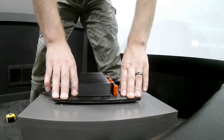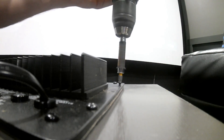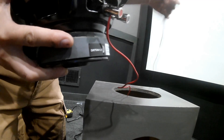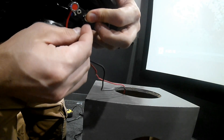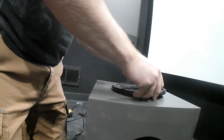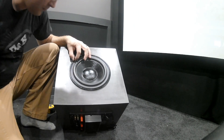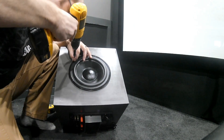The best thing to do is install the plate amp first, then follow that with the subwoofer. This gives us plenty of room to plug up the subwoofer and make sure everything fits nicely inside. Next we need to put the passive radiators in. It's starting to look really nice. I didn't want the subwoofer moving on me, so I installed a few rubber feet. Now let's go test it out.